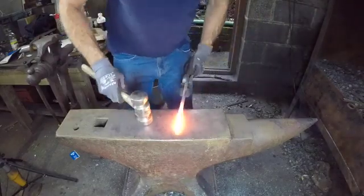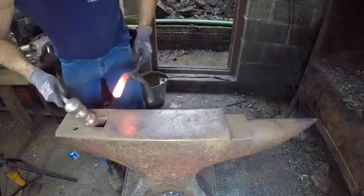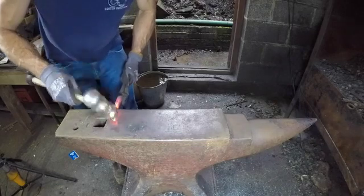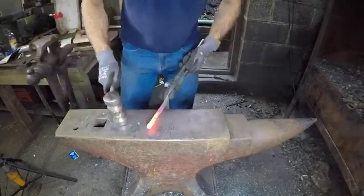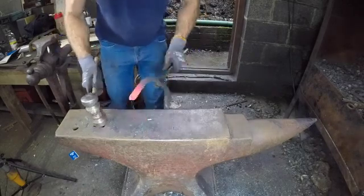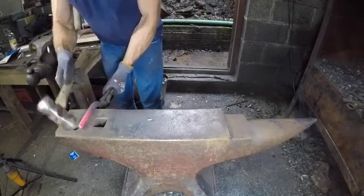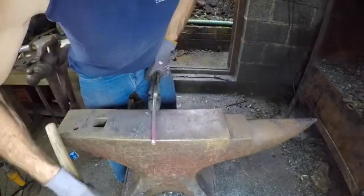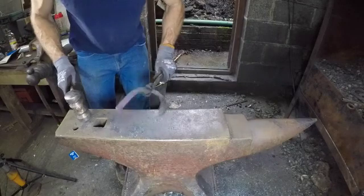The inside heel is quite an important part of a shoe — it allows us to differentiate between the inside and outside. The design of the inside heel is so that it's as safe for the horse as it can be, should it stand on itself or catch its other limb with the inside of the section. We start making it in exactly the same way as the outside heel, gradually folding the concave section in without squashing it, keeping hammer blows quite upright as I come in. Once the heel is two thirds finished, hold it nice and straight on the anvil and by angling my hammer gradually blend the concave section in. This is called the safing — it gradually chamfers the concave section in, going from maximum chamfer at the heel to no chamfer just behind where the inside heel nail will be.